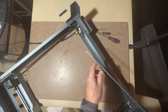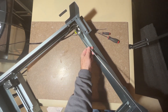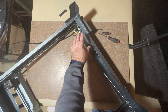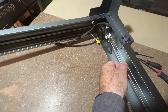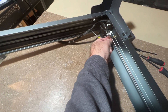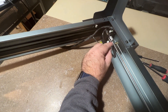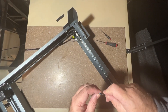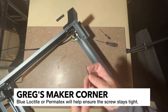Next up, we're going to install this smooth rod. It's going to go all the way to the coupling that sits on the motor. In order to get this to fit in, you're going to have to loosen this screw, insert it, and then tighten it up. I'm going to insert this through the front of the frame — it's also a lot easier to leave your frame upside down when you do this step. I'm going to slide it all the way down and into the coupling. I'm going to back this screw out and put a little Loctite on it — I've got some blue Permatex, similar to Loctite. That's just going to make sure it doesn't come loose over time, and I've got that in there nice and locked in.